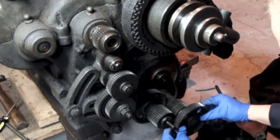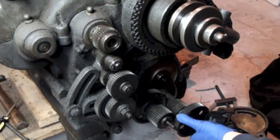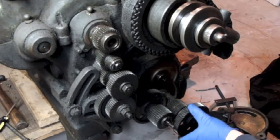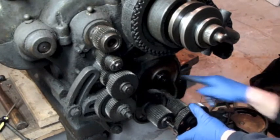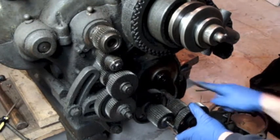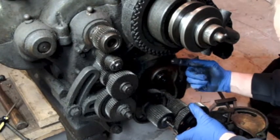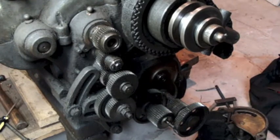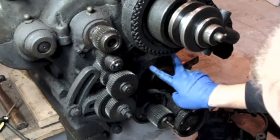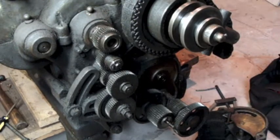That gear is not going to just slip off — something else is holding that on. Check it out — there's a collar here with a set screw in it. I wonder if I took that off whether that whole lead screw — this is the end of the lead screw right here — would slide out. But I'd be scared to do that without taking the top cover off the quick change gearbox first, because this is probably going through a whole stack of gears inside. If I draw the lead screw out, they might fall out of position. So: headstock first, then the cover for the quick change gearbox, and lead screw and all that later.